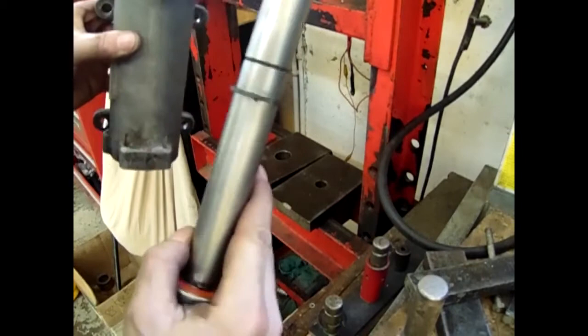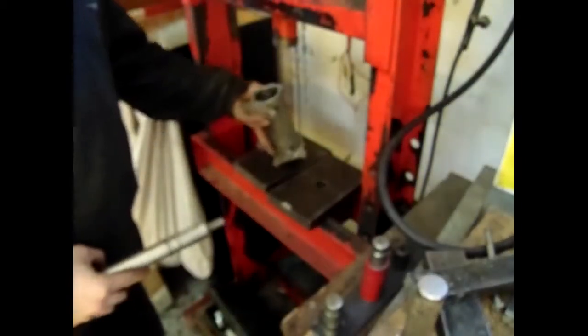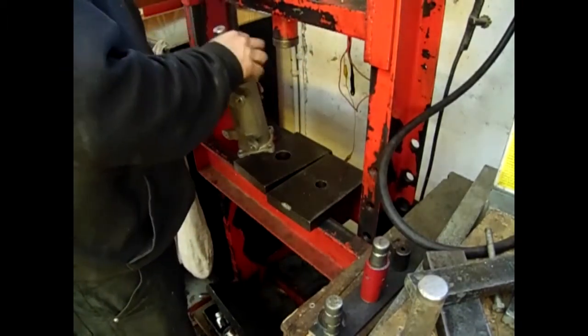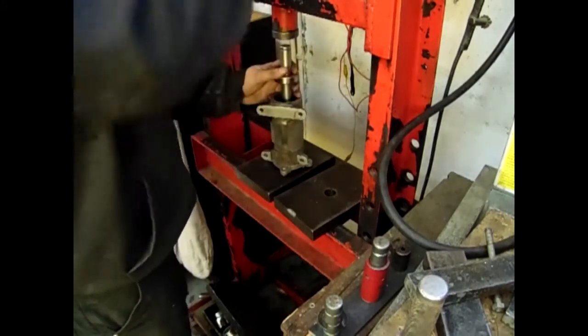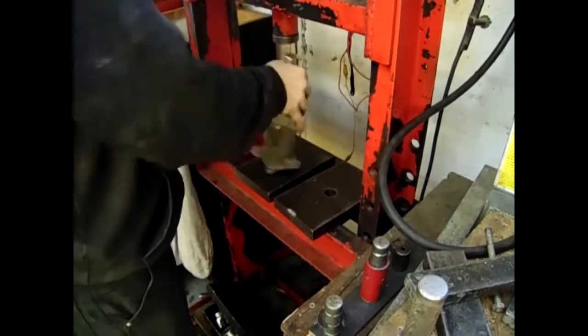Press the shaft end bearing into the body from front to back. It is imperative to press the shaft in straight, as it can damage the case and/or bearings if not centered. Again, if you feel like it is locking up, stop and investigate.